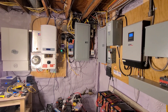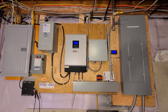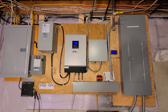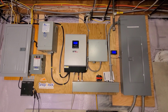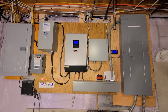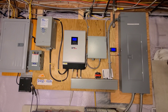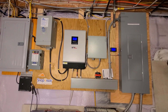So I'll just go over kind of what I have here. This is my battery backup system. This is a PIP 5048MG inverter with a 5 kVA transformer on the output of it that takes the straight 240 volt and turns it into split phase 120/240. And then my protected loads panel on the left. Then on the right hand side, that's my battery combiner panel. So that is a Square D QO load center with two pole breakers.